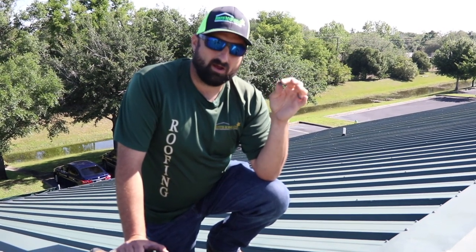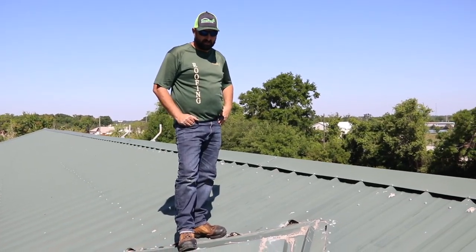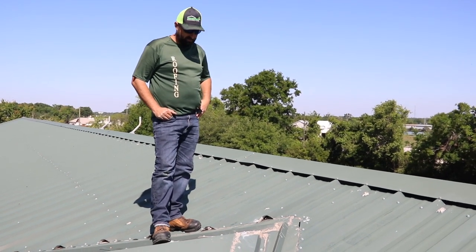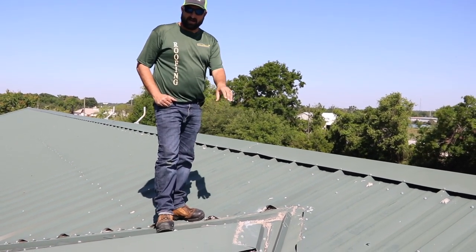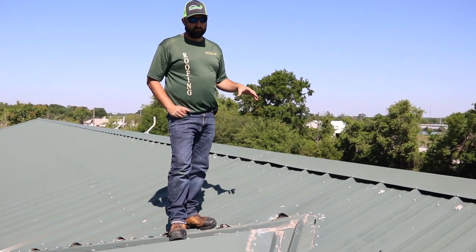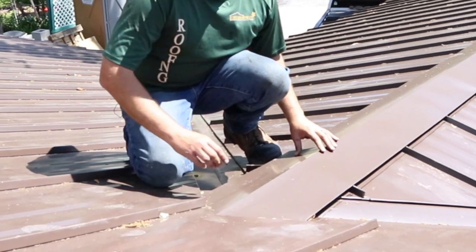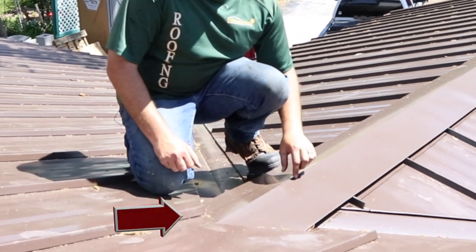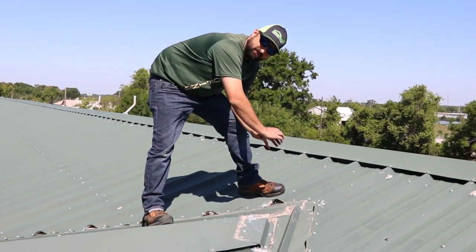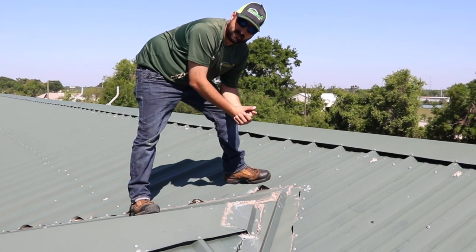In this case they used the same screw for every aspect of the roof, and that is not the right way to do it. We've got a major roof problem here. This is a big transition — you've got a valley, a cap, and your panels. If you saw earlier in our roof, this was all covered up — the cap actually came through here and underneath the panel, which protects you from the seams that form when valleys come together.